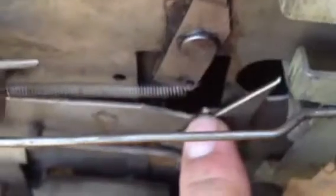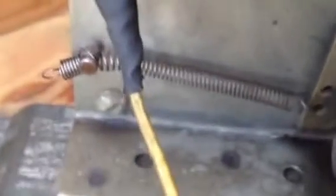Let's move over to this one here. Again, this was really bad inside — you couldn't really see these at all. You can see they're all cleaned up now. I lubed them, put some super lube gel on it — it's a grease that won't harden — and a little oil over the top. This thing is flying now. We did a lot of cleaning, oiled a lot of the pivot points on these mechanisms, and checked the springs for tension. The one problem we had was the spring down here wasn't taut enough, so we fixed that.